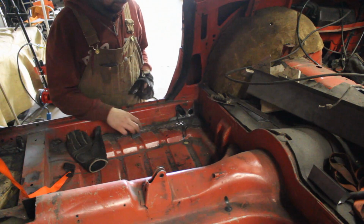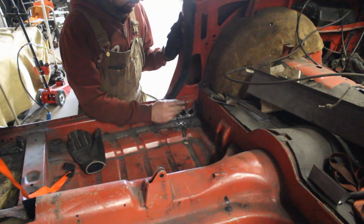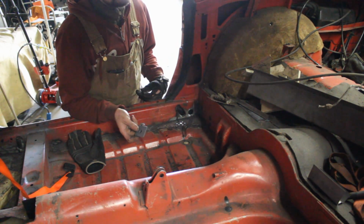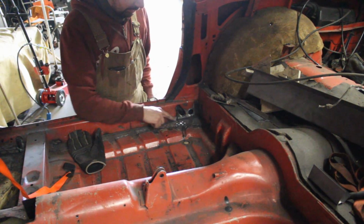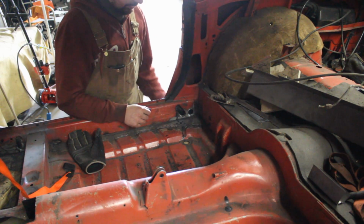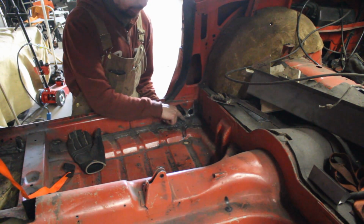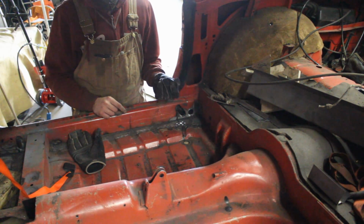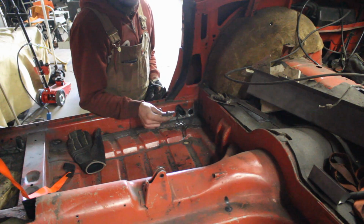Alright, so today is the day when we keep discovering a lot of forgotten stuff, and one of these things is this nut here that I believe, I don't know, I'm not familiar with GT6s yet, but I think this is a nut for the seat belt, and it needs to come here. That's why somebody asked me what was this one hole with 6 small holes around it. Well, that's for this. This goes there, underneath, and now I have to do 6 plug welds here. And that's for this side, and for the other side I don't even have the nut because it was missing. I don't know how. So before I weld this one here, I'm gonna go find the same nut and make the same piece.